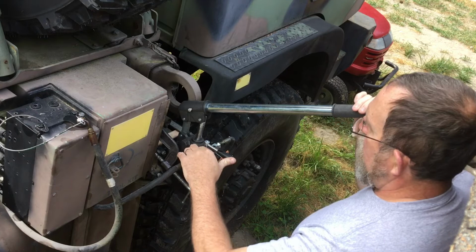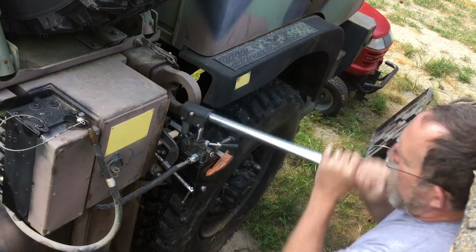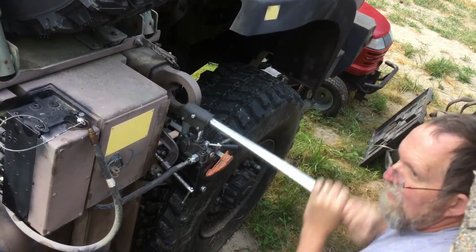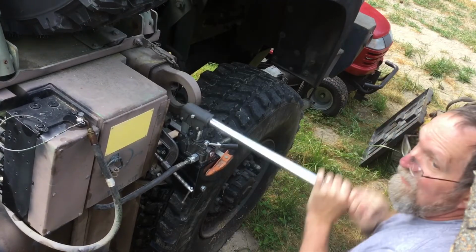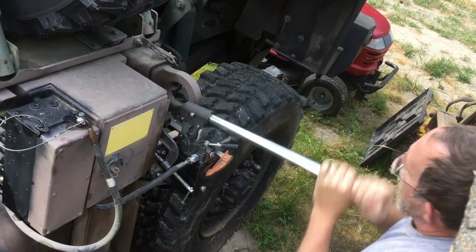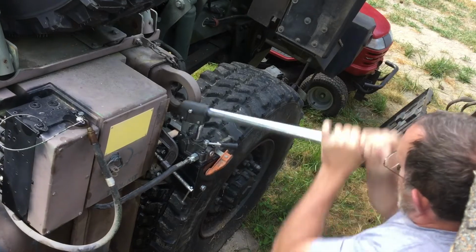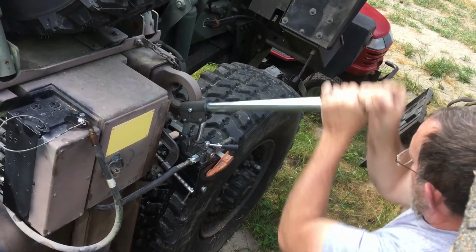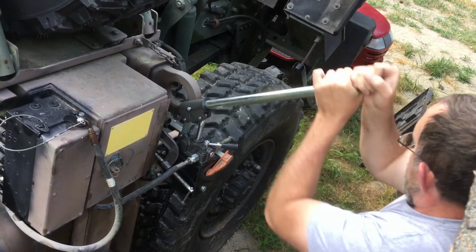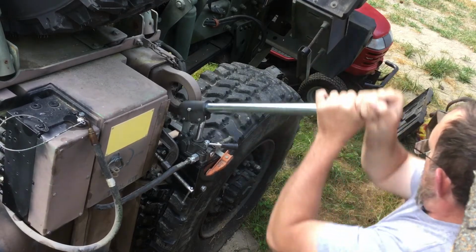Anyway, here's how it works. Did I mention it was fast? It's very fast. As I go up here, I start to get lighter as the center of gravity starts to shift over the pivot point. I noticed, though, that it gets hard again just before I go over the balance point. Right here, it starts to get hard again. I haven't quite figured out what's causing that yet. It might just be loss of mechanical advantage.